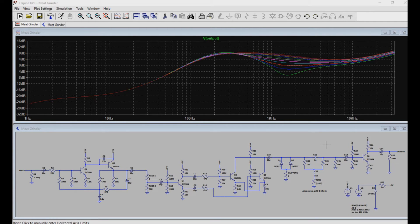You'll also note that a lot of amplification is occurring at 300Hz and above frequencies, delivering that harsh octave-up fuzz sound. As mentioned in the build doc, if you change the values for R22 and R23, increasing those resistance values will shift the scoop point back towards the bass frequencies, and reducing the resistance of those two resistors will shift the scooping response more into the treble.